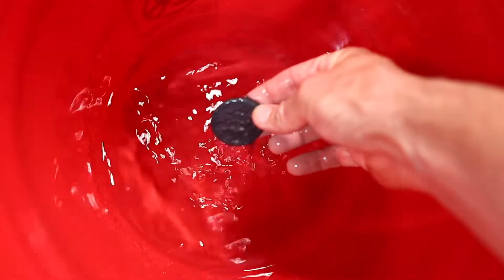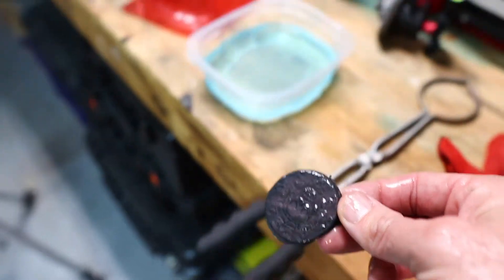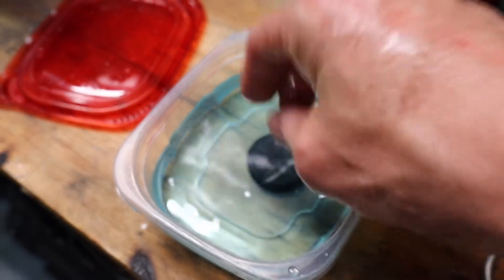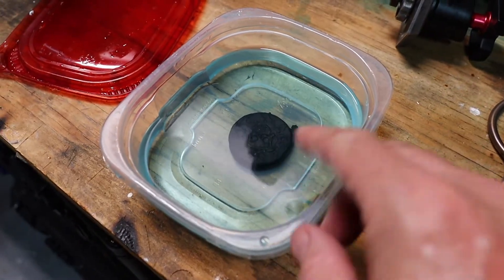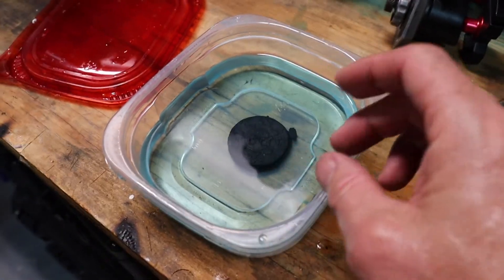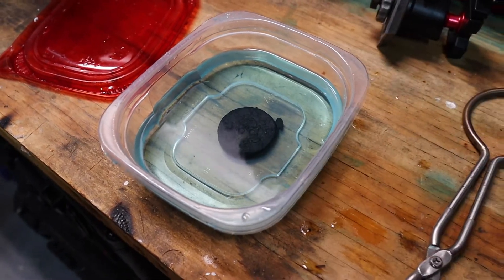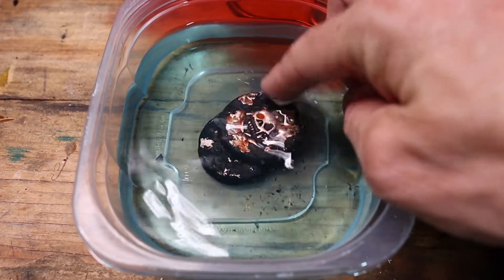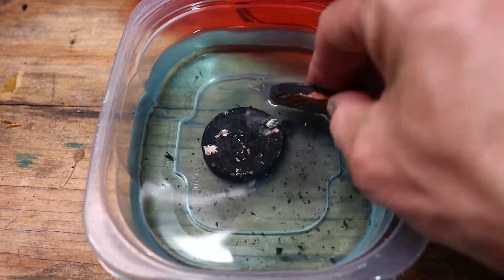However, copper still tends to come out oxidized, so I have this little trick. I've got right here a vinegar and salt bath — you can see it's a little bit green from some other copper I've had in there. You put it in there, wait about an hour, and it's taken all that oxidization off. If you actually heat up this solution, it works a whole lot faster as well. Look at how that oxidization layer just comes right off.